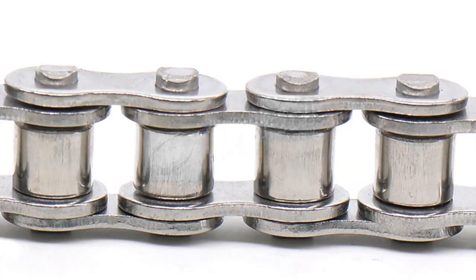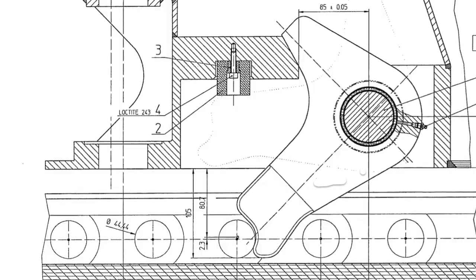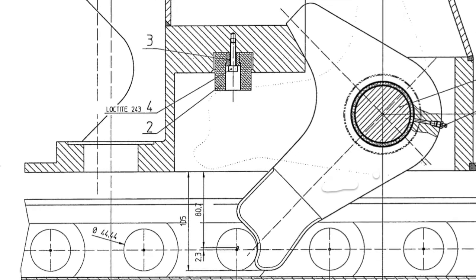It's basically a roller chain. And when I say roller chain, what I'm referring to is in between the links, there is a barrel that the chain dog latches onto, and that's what actually lifts the train up. So those links on a lot of older chains were just fixed steel shafts. And what they would do is they would just rotate with the chain. So it causes a little bit of extra wear in the componentry in there. The chain dogs will wear down a little bit more than usual. You have to keep them extra oily.